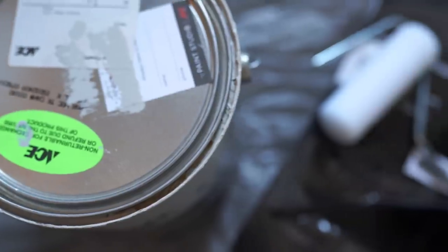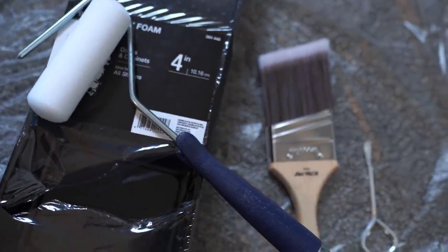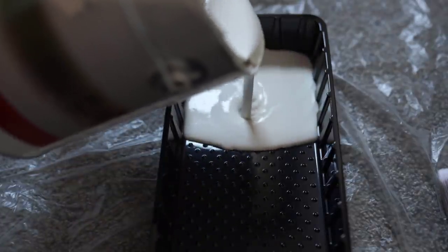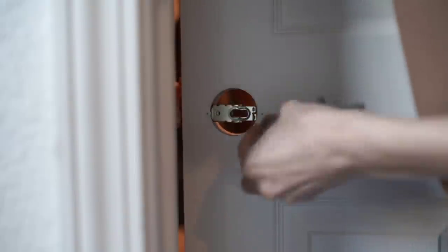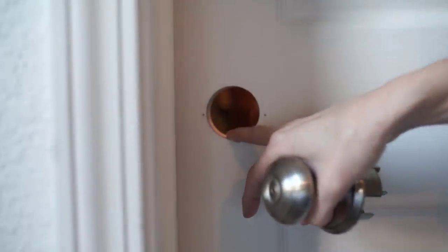If you are painting doors, this is my favorite tool to use. It comes in a little kit usually at Home Depot — it's the little roller for smooth surfaces — and then I also use a paintbrush for the doors with the little inlets. They're kind of a pain to paint, but with these two tools it makes it very easy. So I'm going to start by taking off our hardware. There's usually just two little screws in the back that you unscrew, and then they pop out really easy. I have been intimidated by doorknobs before at our old house, and it is very, very simple — trust me.